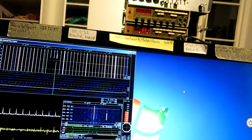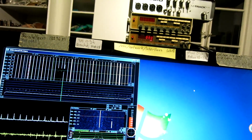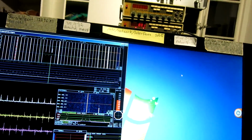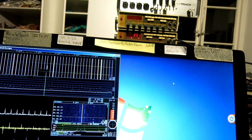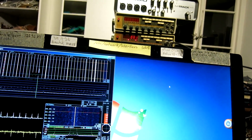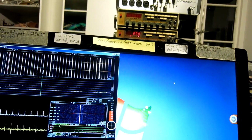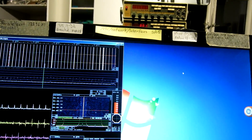So these problems can be removed in the time domain or in the frequency domain. In a smarter system, one could use information from both the time domain and the frequency domain to make this far more efficient and completely automatic. But since this kind of interference is not very frequent, normally this type of interference varies with time. The switching frequency changes and it may be modulated by 100 Hertz and there may be other problems. So I have not put any effort on doing this better, but it can surely be done.